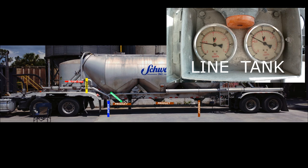I need to close my aeration valve about halfway or so, because I am losing too much forward airline pushing power pressure into empty pods. Need to hold some back. If I didn't adjust the aeration valve, the line gauge PSI will get real jumpy. So that's how you know when the product is not flowing well, and you will need to make adjustments to aeration valve and adjustments to the product valve.